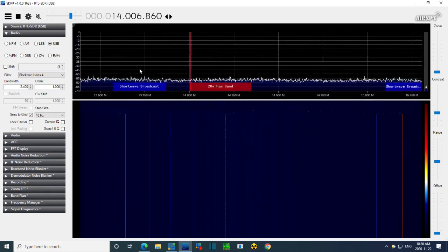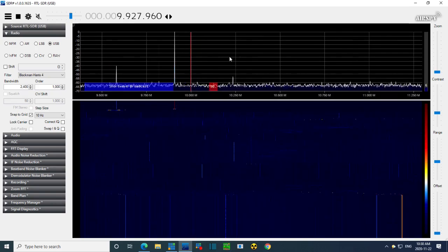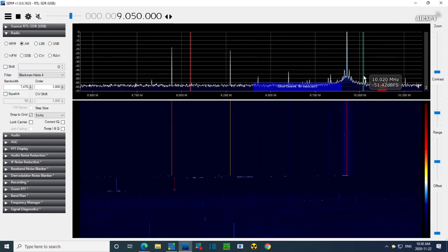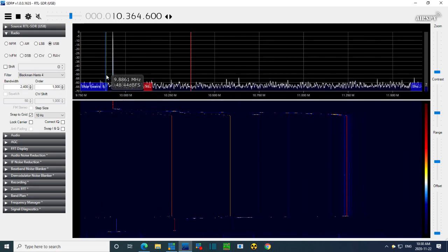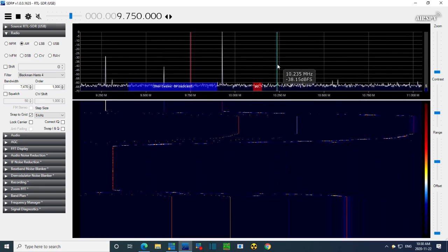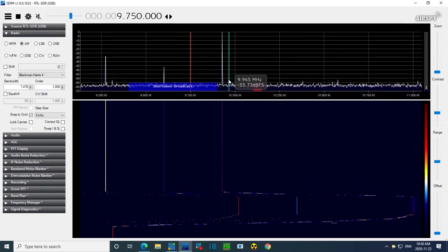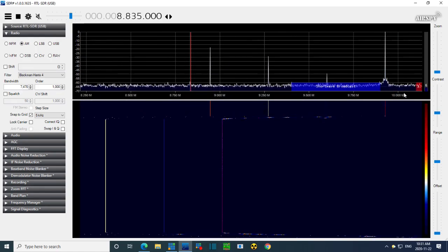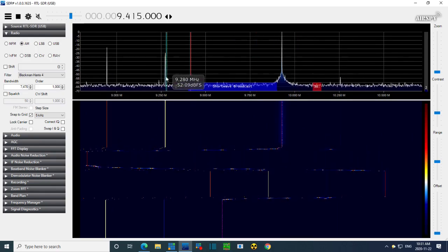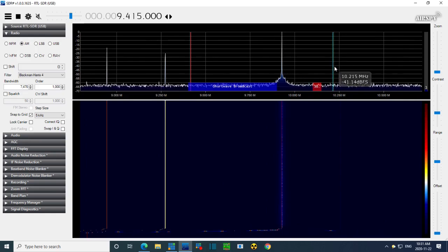Is there any more of these out here? Is it real? I don't know if it's even real, because I don't see anything else. Because it moves funny when I move the SDR. This one too. So this is very large. Now this is the real local oscillator coming out of the radio right now. Very strong signal. Much weaker now. Well, I don't understand what's going on. It seems like an SDR effect here I've never noticed before. Strange. These other guys here, I think these are all SDR-created signals. I think if we tried to pick these up with a radio, we wouldn't pick these up with a radio.